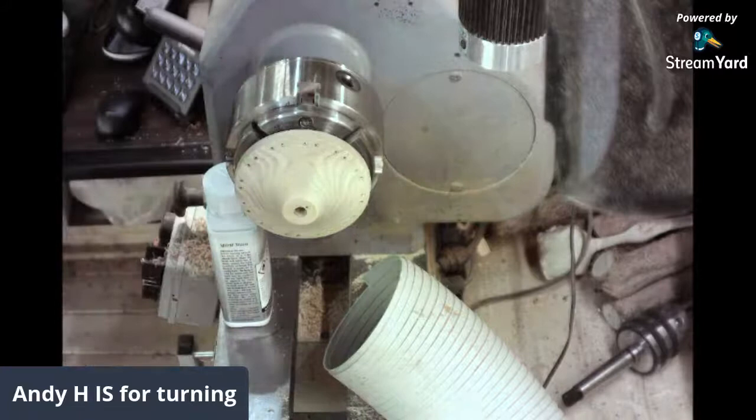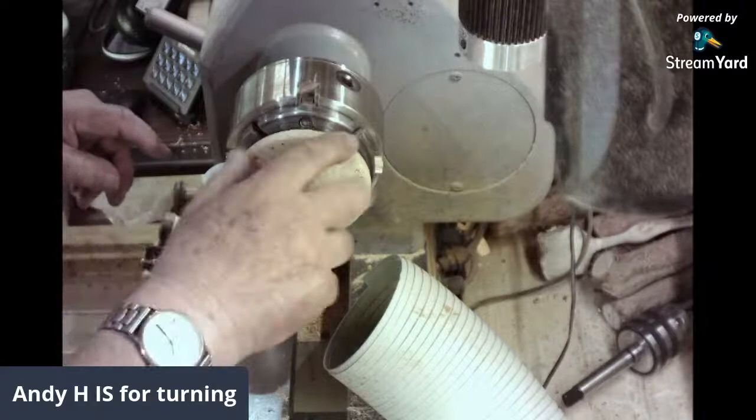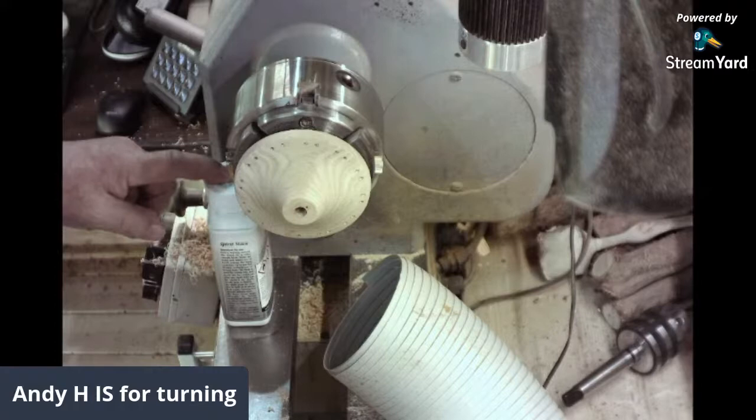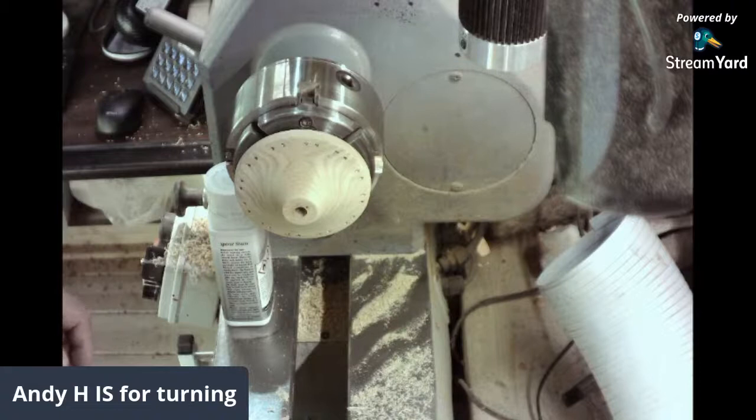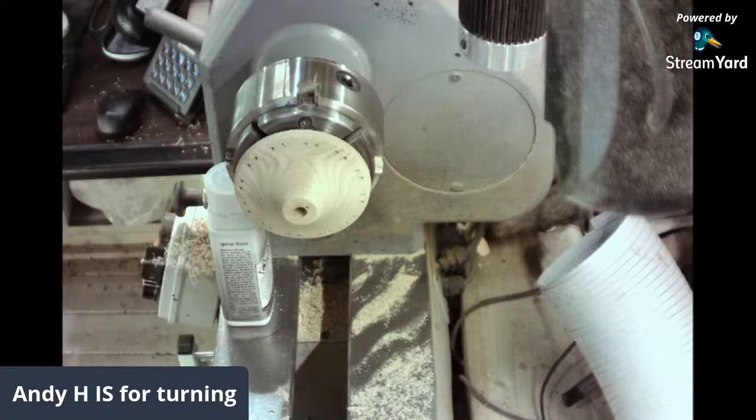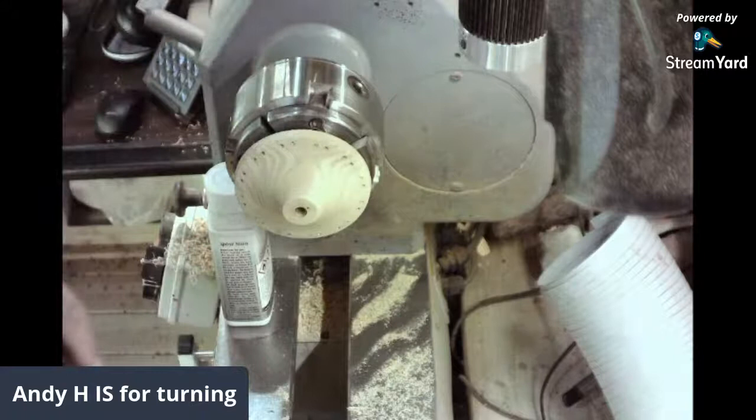Okay, so this is going to be stained. So I want to take it a bit finer and do the staining before I put it together. Can you stain over Yorkshire grit? Not very easily. Not really, no. You've got to wipe it back with meth, so if you can go down to 400. I'll sand it to 400. And, in fact, I think we got there. I'll do it with 400 anyway to make sure. And then I can stain it up, turn it round, finish the underneath. Then that bit's, apart from drilling, is done, isn't it?